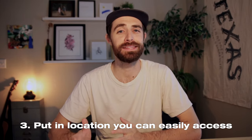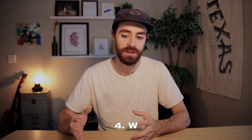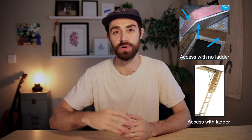Also think about how you're going to get to this access point if it's in a bad location. Can you put a ladder there to climb up into the attic, or is it in a weird place? Is a bed or dresser going to go there? Find a good place where you can easily access this space. The last thing to consider is whether you're going to install a ladder within the door or just install the door, like I'm doing here in this video.